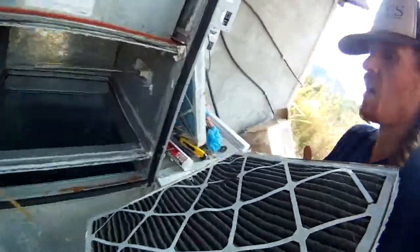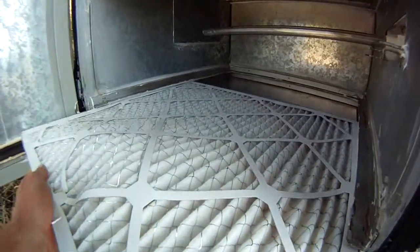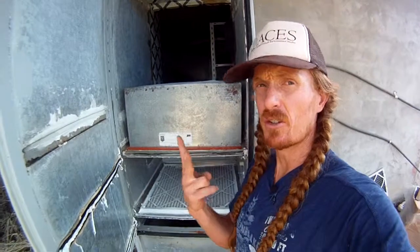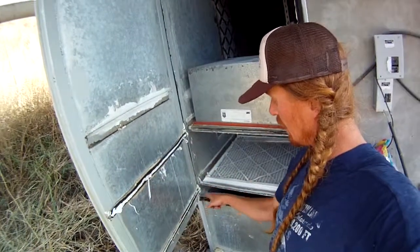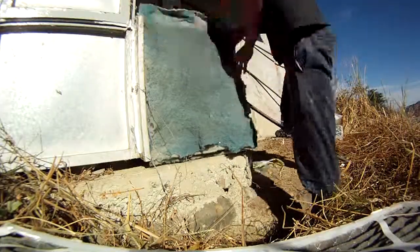What I'm going to do here is change out this filter to protect the HEPA. You can see I've got my seals — when the door shuts, it lines up right on that. I've got my new filter in there. This HEPA I replaced two years ago. This thing will last a while as long as I keep these pre-filters clean and rolling — it'll protect the big guy. I dropped a little bead of silicone on these things; I seal all the edges with silicone so nothing can get around the outside. Now I'm ready to shut the door and close it back up. After I get this sealed back up, I'm going to get these pre-filters back on and it's ready to go — except I want that silicone to dry overnight. I probably won't crank this thing on until tomorrow, maybe the next day.